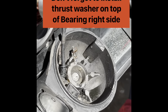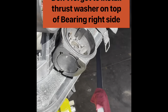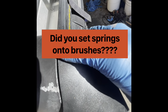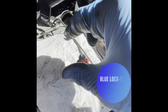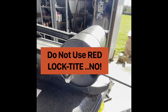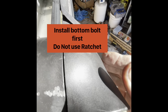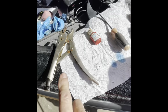This side looks good. We have to make sure that this cable goes around the cable clamp, then put this side on. Looks like this one's lined up and that one's lined up — went right in, no problem. After cleaning the bolts, put the bolts in. I had to put the mark quite high on this side to get the bottom one in first. Do the bottom one in first — I actually had it hooked to a pair of vise grips, then brought it back to the mark and this one started just fine.